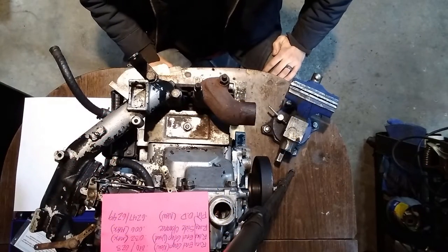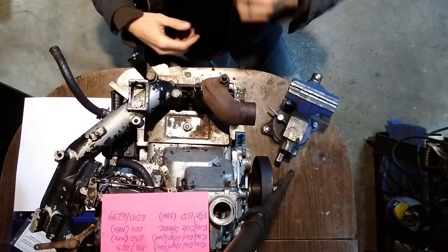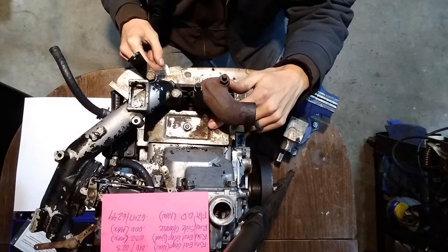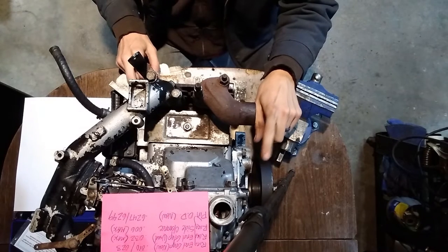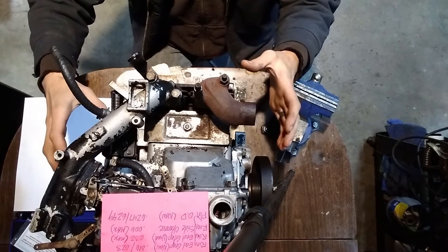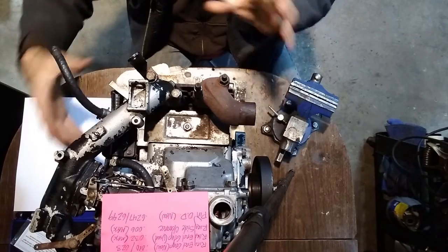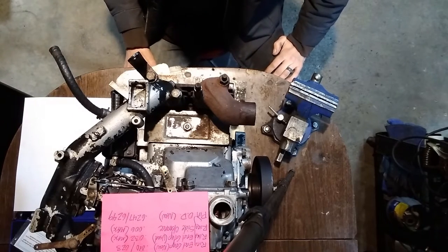Since we already pulled off the cylinder heads when we first started tearing it down, the next step is to get a visual on the valve covers. This is the valve cover for the cylinder jug closest to the PTO end. On the 1882 in the Cub, this sits in the front — this is the PTO end. I think of this as the front and this as the rear of the engine, the flywheel side. But conventionally, the flywheel side is considered the front, so if I say front or back and get it wrong, it's because it sits backwards in the Cub.